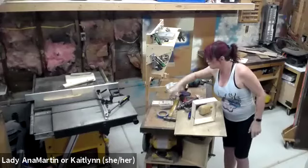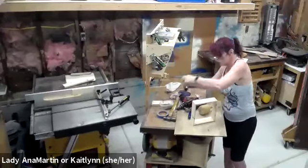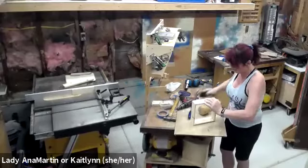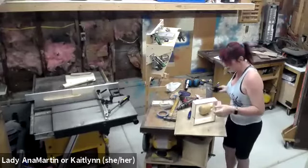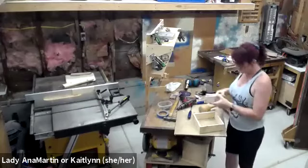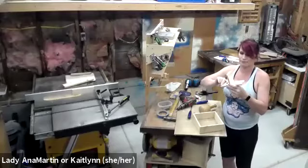If you're going to use screws, which I definitely suggest because they are much stronger than nails, I don't trust nails at all, then a countersink is the thing to use, which I have on that drill right now. Demonstrate that in a minute. Okay, so I've got this little square frame. And then I've got these two pieces that I've cross-lapped, like so.